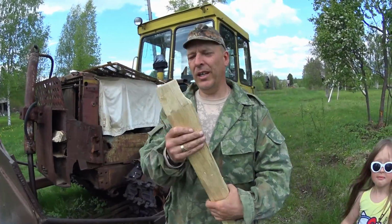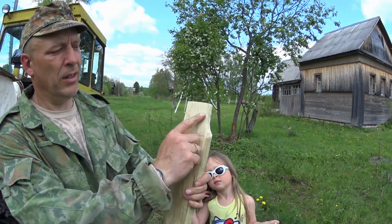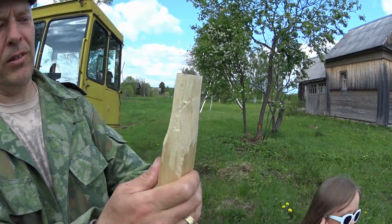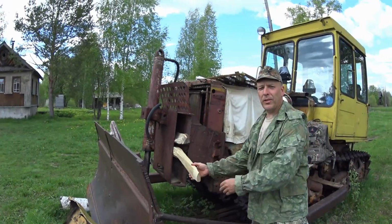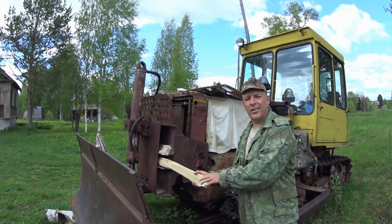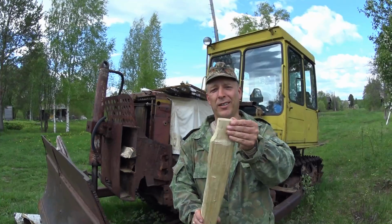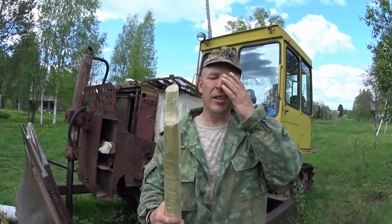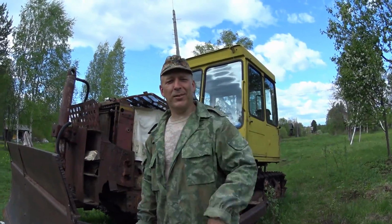So after putting on the axe head, I can see small marks here where I need to take off some material. I'll put it on my expensive workbench here. Remove material, put the head on, remove material, put the head on, until it's there. The more time you spend on fitting the haft to the eye, the better it will fit. So guys, I'll get on with it and get back to you later.